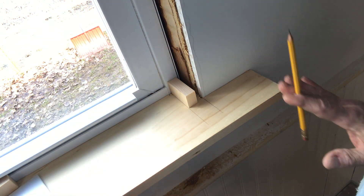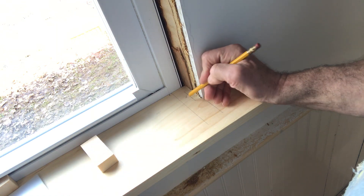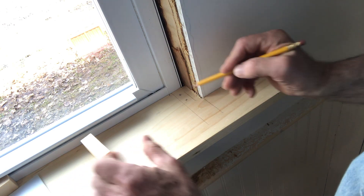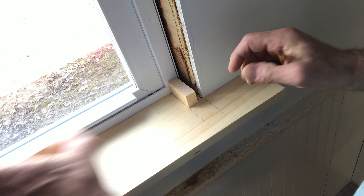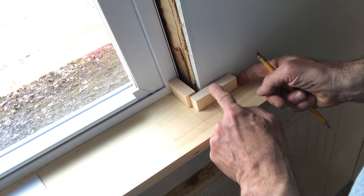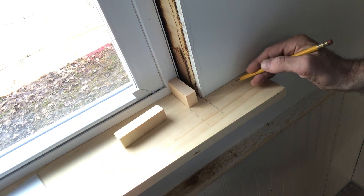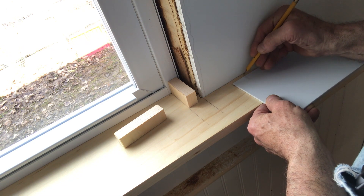What I normally do — I should explain — is I build frames in one piece and set them in. Over here I'm marking on the other side of that. I'm going to make a couple of marks here because I like to screw up through the bottom of my extension jambs to the sill, and I'll drill one-eighth inch pilot holes there before I attach that. I also want a reveal here for my casing — it's going to be one by four. I don't want it flush out here; you always want a shadow line, you want a reveal. So I'll come back like that with this piece and make a mark over here, which is where the edge of that casing falls. And then I want to be an inch past that.